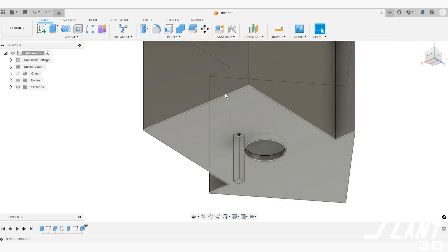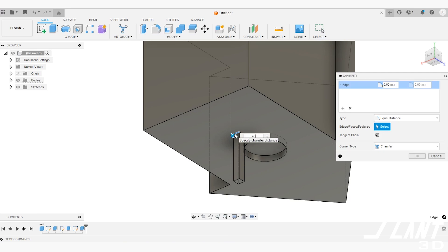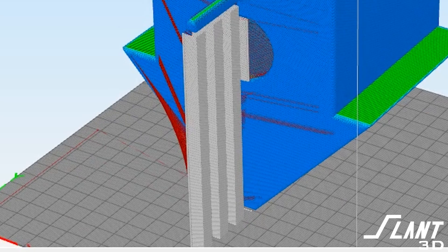The other issue is the landing peg. The most obvious solution is to drill a hole in the side and have somebody insert a peg after printing. But that's not ideal for mass production because it adds a step where human hands have to touch it, and it reduces the opportunity for print-on-demand. The best approach is to design the peg with a chamfer on the bottom. Support underneath that peg is not the end of the world — there's not a lot of it and it takes basically a flick to knock it off. Any competent manufacturer should be able to address that.